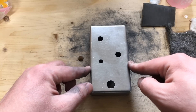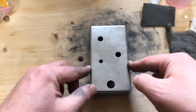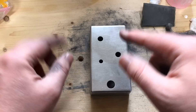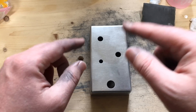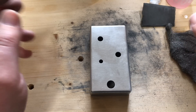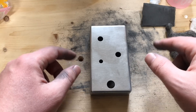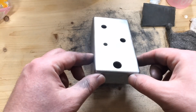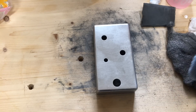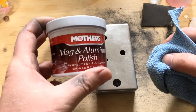In the end I decided to go for a mixed approach, as the nail lacquer remover by itself was not working on this blue ink. I decided to use that together with some sandpaper, starting from 600 grit, going up to 1200, then 2000, then some steel wool. I cleaned it off nicely — it still has some imperfections, but now I'm going to finish everything with a microfiber cloth and this aluminum polish.